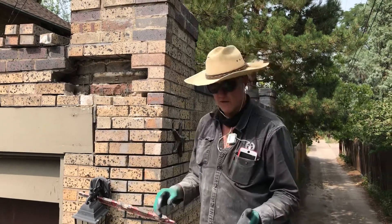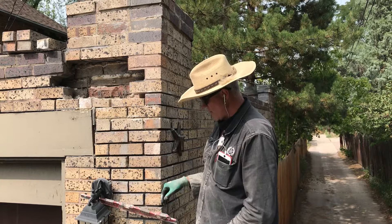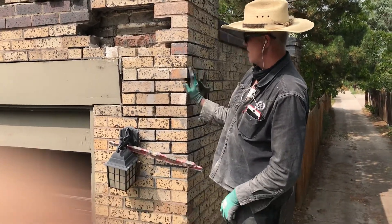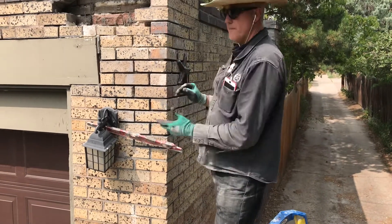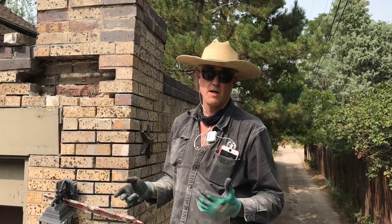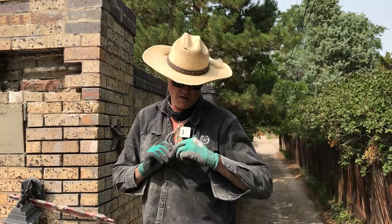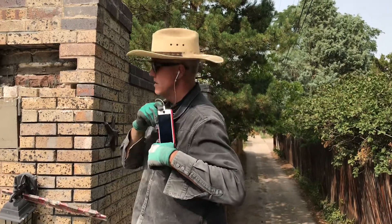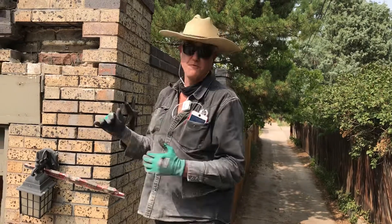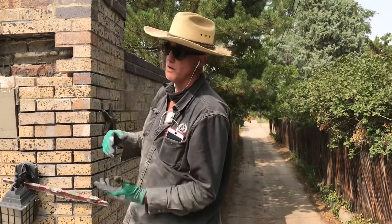We've run into a little bit of a problem here. Coming up the wall, I was trying to keep my bricks plumb to the corner, and then we're coming to here and we're kind of jumping out again. When you're trying to fix bricks being out of alignment, you can only really do so much in a short span. In two or three bricks you can't really fix things that are that unlevel — you'd have to take it much further back and then rebuild it.